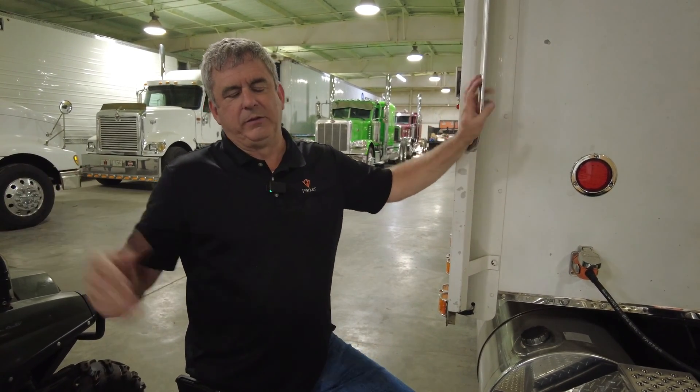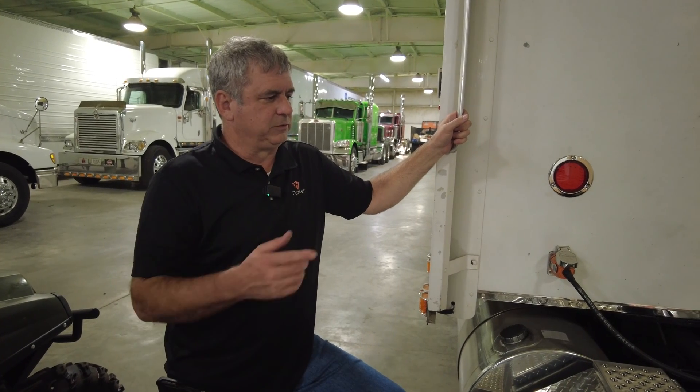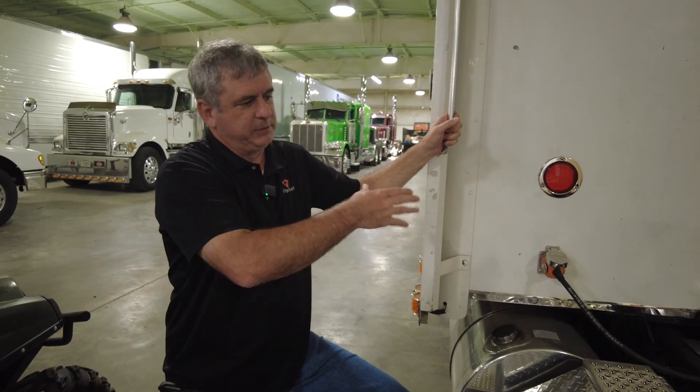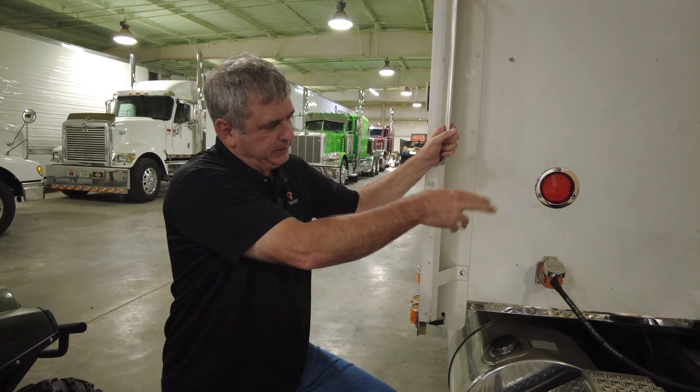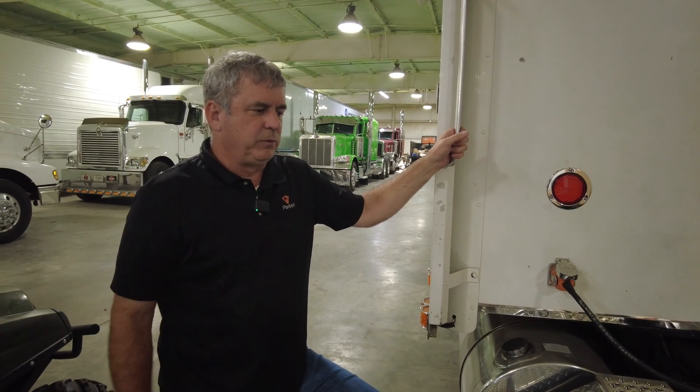Most people recommend 35 to 50 gallons, but by doing 40 gallons across that entire length, we have a lot more metal surface area where the oil runs against the tank. The tanks cool better, and it saves a lot of money on that thousand or twelve hundred dollar line — now it's only a couple hundred bucks because it's much shorter. It also shortens the return line back into the tank because the tank is exactly where it needs to be — basically right under the connections for the trailer.